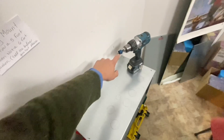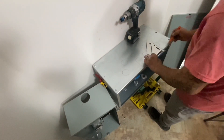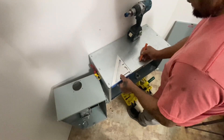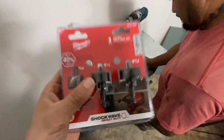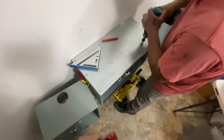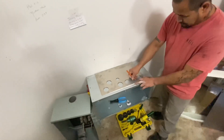If this Harbor Freight half-inch Hercules hole saw can cut all these holes again, she will have paid for herself twice. The next thing you're going to do is cut your holes in your wireway — if you have a wireway; if you don't, you need to get one. The quickest way is with these impact-rated thin hole saws. The only one you really need is the 7/8-inch — you can get them from Home Depot.